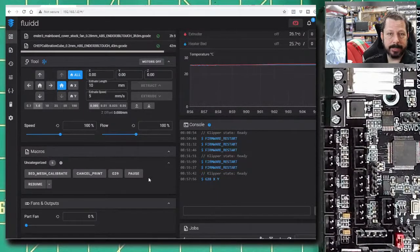It opens up this board now. I'm not limited by the board having to do the processing of the G code. The Raspberry Pi is doing the processing. The board can run at full blast, just controlling steppers and measuring thermistors and stuff like that, which it's very good at doing.